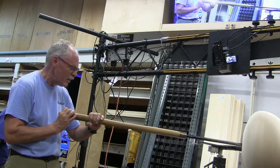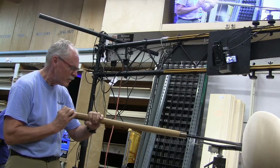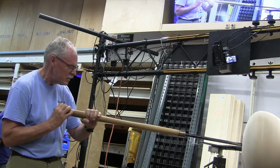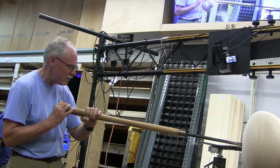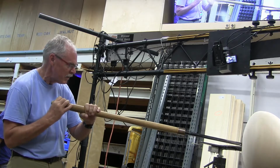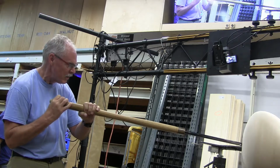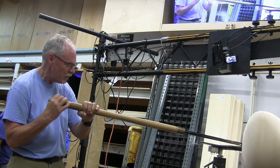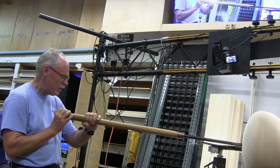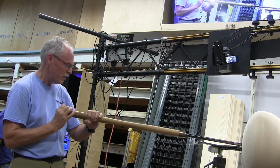When I drill the hole, what I usually do, in fact, the Milwaukee tool has great Forstner bits, and I use a 2 9/16, which is their biggest one, and I'll just punch a hole before I start the hollowing process. I'll punch a hole as deep as I can go, usually all the way in. So the hole right now is about 1 inch from the base.